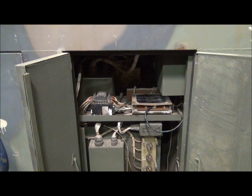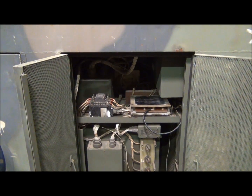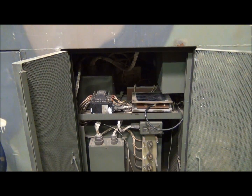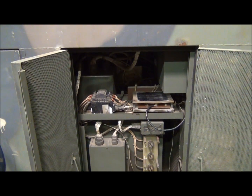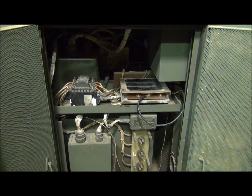If you do this modification the way I've shown, you can get almost the full rated output out of the generator, but not quite. We're still limited to the current set points configured for three-phase. In this MEP's case — it's a 15-kilowatt unit — we actually get just a little over 14 kilowatts before it trips. That's still pretty useful, that's almost the rated output. The overloads require you to be above the trip set point for several minutes, so you can pull 15 kilowatts or more without any problem as long as your steady-state draw is less than 14. The trip set point comes from these current transformers here and back here. You can take one turn of the windings out of them to reduce what the load measurement unit sees, but that really isn't necessary because you can get most of the rated output out of the generator.